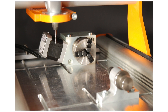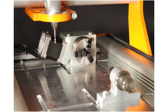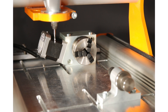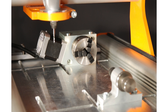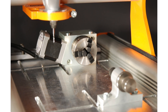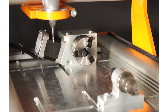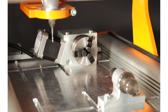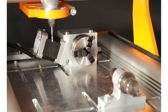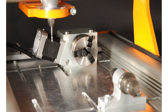It's important to keep in mind that the fourth axis only works with Vectric VCarve Pro and DeskProto multi-axis. You need a CAM program capable of manipulating the G-code for the fourth axis. Vectric Cut2D, Cut3D, and VCarve Desktop do not have this functionality, so you would need VCarve Pro or DeskProto multi-axis in order to use the fourth axis in your system.